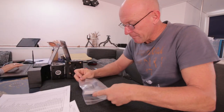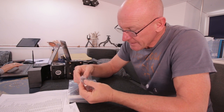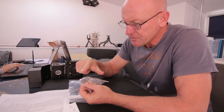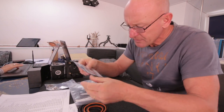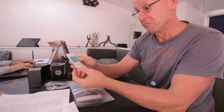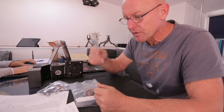Let's see what's more in the bag. Some high pressure connection cones, and I see there are newer type springs for the check valves, and then a lot of small seals and the bigger seals of course, and then some Molycote 111 compound, a little grease to grease up all the seals before putting them in. So let's start this thingy.